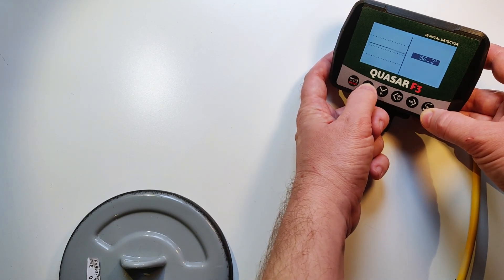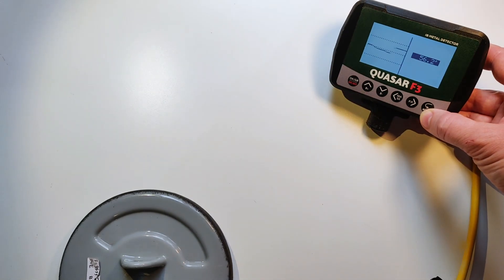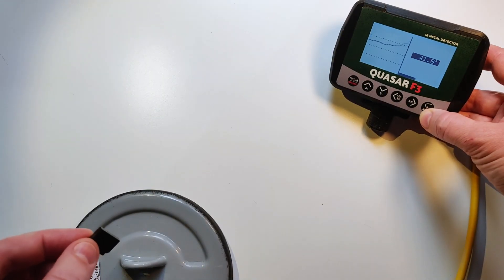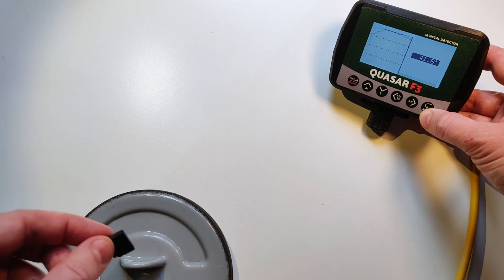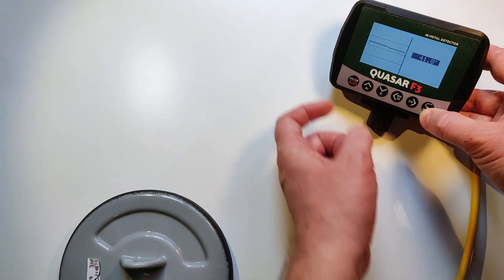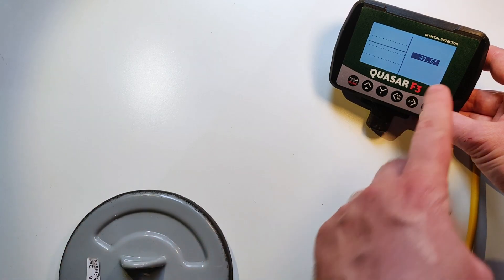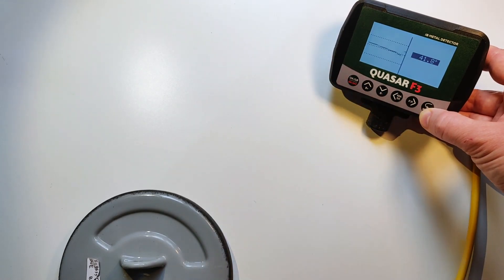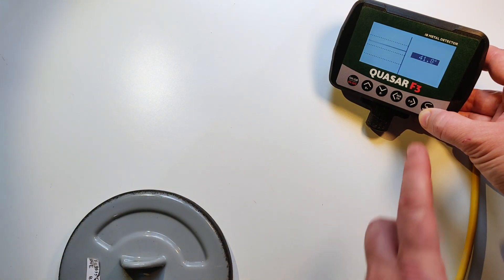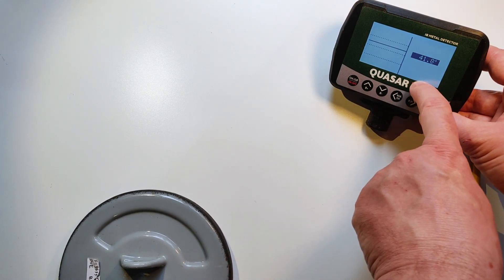I had to move the coil really far from the unit because it was affected by the metals in the unit. We go to ferrite zero, press up, which is normally auto mode. I press up, then take the ferrite specimen and advance it to the coil. You can see below it is a black progress bar. The coil needs to see the specimen so the progress bar begins to move.